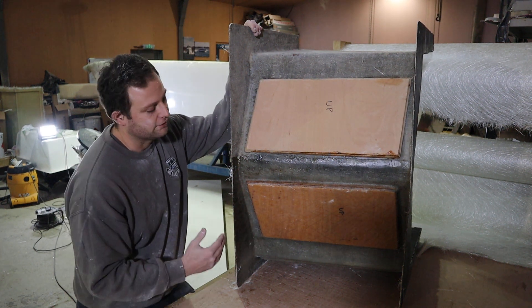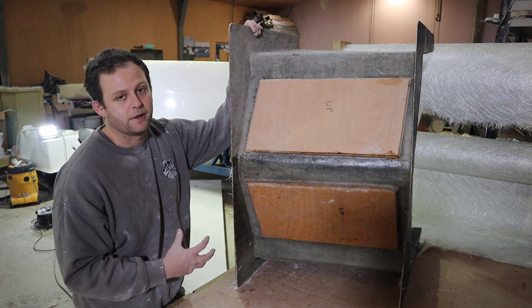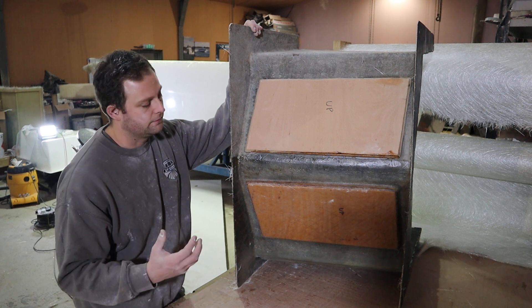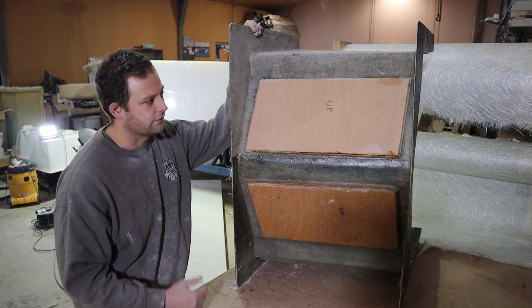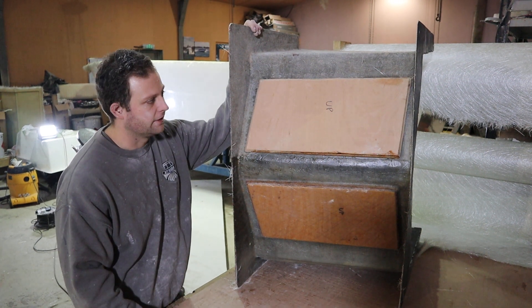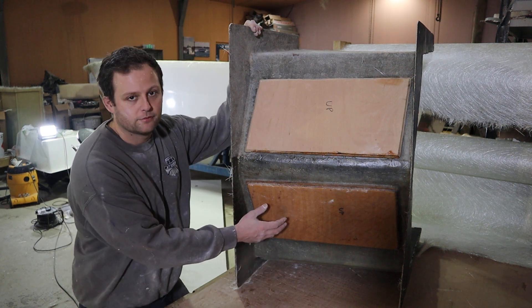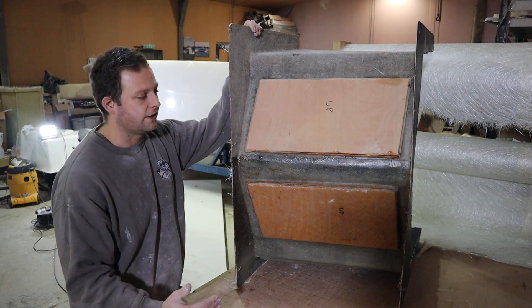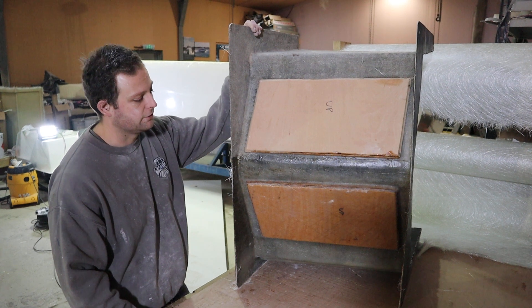Now I could have gone a lot higher — not really necessary to go as low as 300 for this. It was more just to give me a nice base to work from and a nice bit of shape, because different mats like certain shapes and it's just a bit of ease. So I can sand this down and really go for it now. It's also added a bit more stiffness so that the mould's not going to warp when we go into the next stage, which would be to bulk up and really start to thicken up everything.